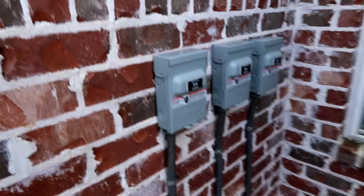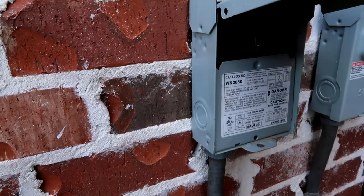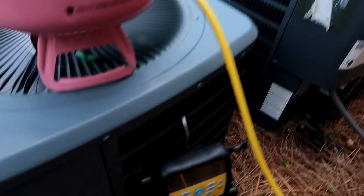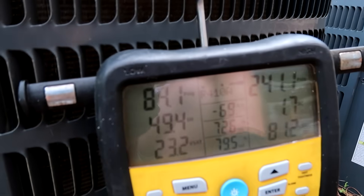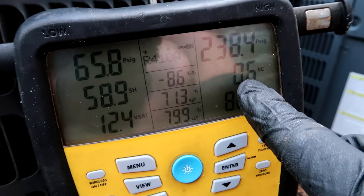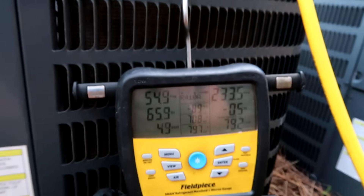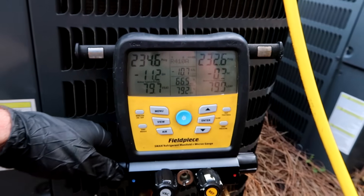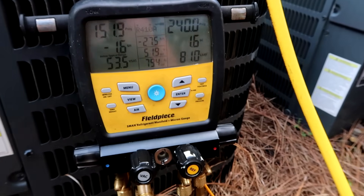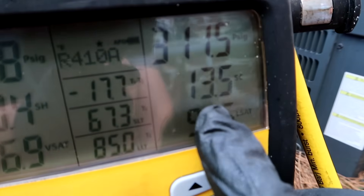The resident up in there is smoking a big blunt, so I won't be able to record inside the apartment to do a leak check, but I'm sure it's low. If it's running and not cooling, 99 times out of 100 with a First Company coil, this thing's going to be low. And sure enough — look at that. Going way low, 70 PSI — there goes the subcool, high superheat rising. Got another leaky coil. I'll fill them up and be back. That's all there is to this one, just needs a gas-and-go. Order another two-thousand-dollar coil.